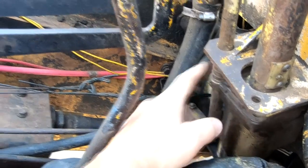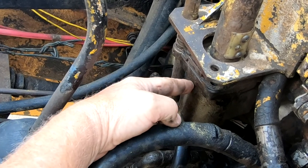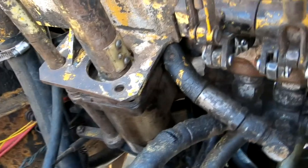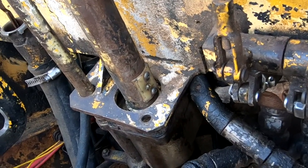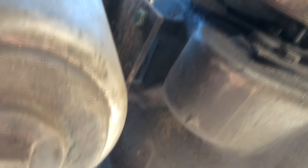So now, as you can see, I've started to unbolt it. I'm going to take it off. I've got to separate this plate — it's leaking right in between here. And I have a rebuild kit for it, so I should have the seal I need. But what a hassle — you thought you had something done and then two new things show up. The other thing is I had to move this oil filter back to its original position. They had it bolted to that little piece of metal up there with holes in it. It was way too far forward — it's supposed to bolt to the side of the transmission. I don't know why it was ever removed from there.